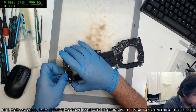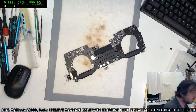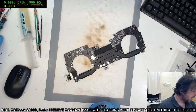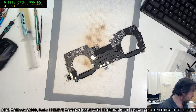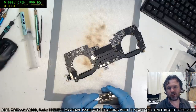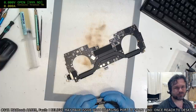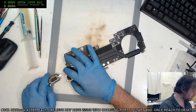But you still always get freaked out by pads lifting. It's a good thing, probably. I had someone bring in an iPhone SE to me, the old SE, like the 5S SE. At first it looked like it was just going to be a battery, and it passed the initial battery type failure behaviours. But once I replaced the battery and it's still misbehaving, I'm thinking, oh great, this is a TriStar, or maybe if we were lucky, a Trident chip failure. But given that they just purchased it, I said to them, just send it back to whoever you got it from, they've dodged it up.